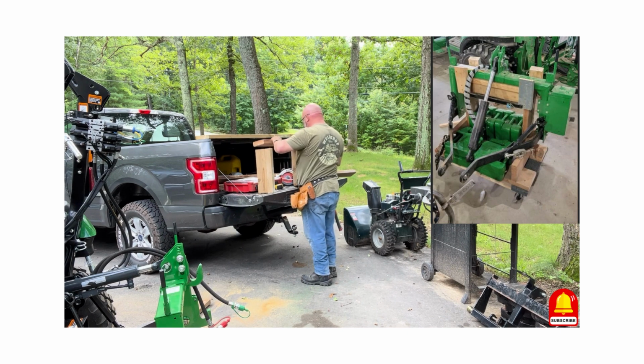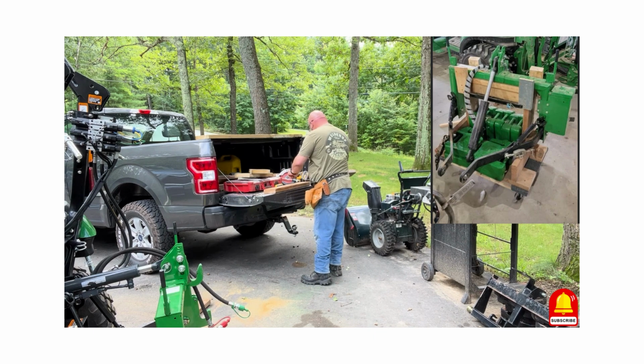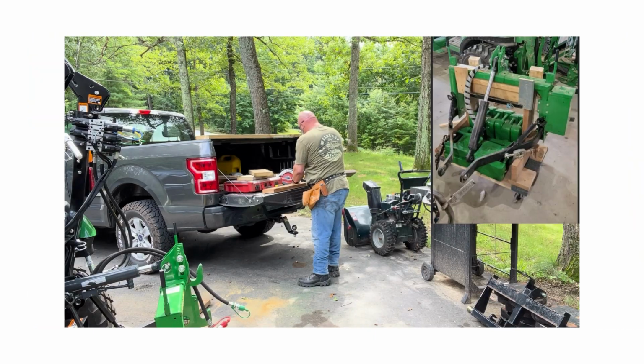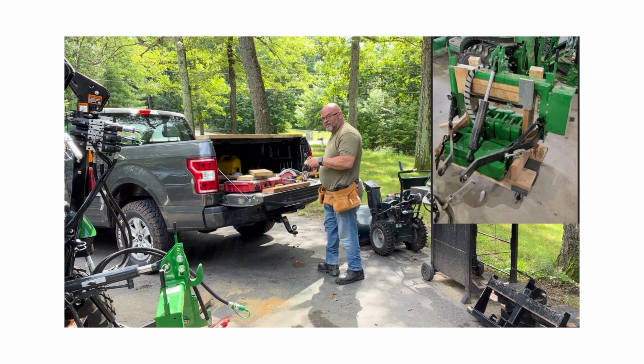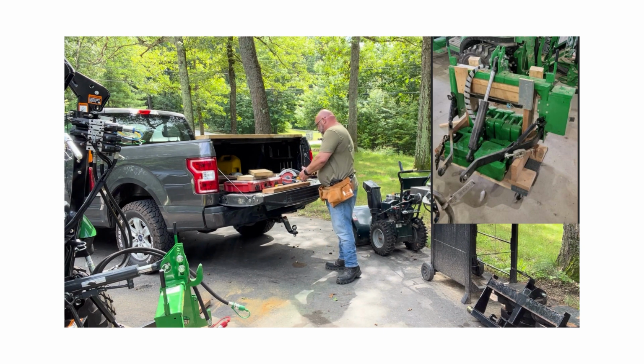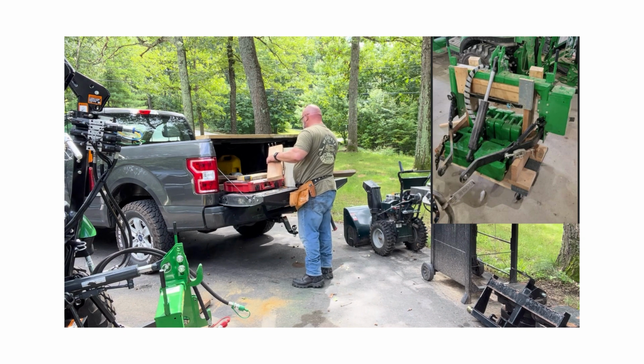So we'll take out those screws I just put in. And do it. Make sure you go in a little from the edge where you're going to put it, and don't put them too close, and don't go too close to the outside edges because it will split. Now, doing a project like this, it doesn't matter so much. If I was doing something with fine wood, I would definitely pre-drill these holes.